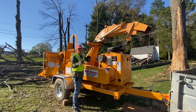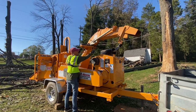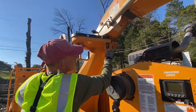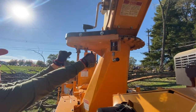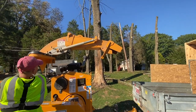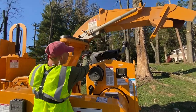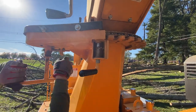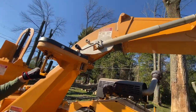If you want to change the direction where the wood is going to be shooting, take this pin, bring it up here, and lock it right there. Now you can move the chute and you'll see this thing up here is going to turn any way you want. Once you have it lined up, lock it into the tooth — you can see there are teeth here — and when it snaps, it's locked in the tooth.